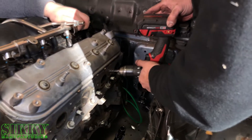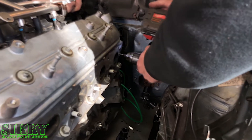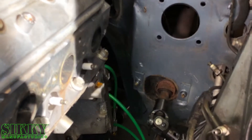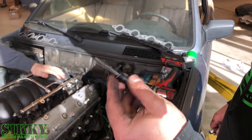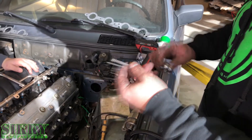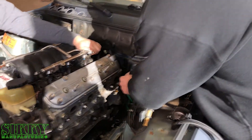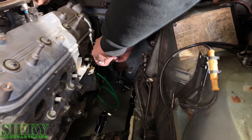You want to check your depth of your hole and get one of these to make sure you're not going to go too far. It looks like we're in about half an inch, so should be good. So we're using a stud remover, broken bolt remover — a bolt extractor and a tap holder. In theory, this tightens up and screws into the stud.